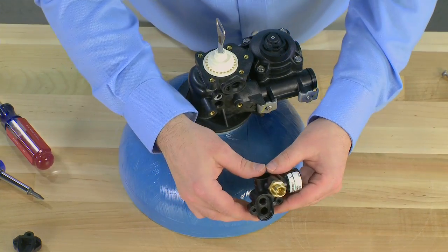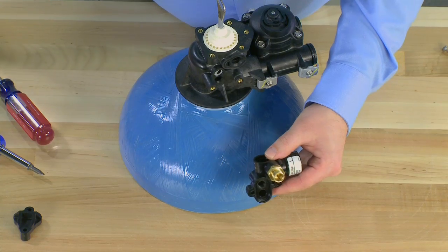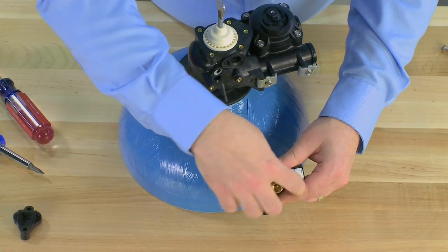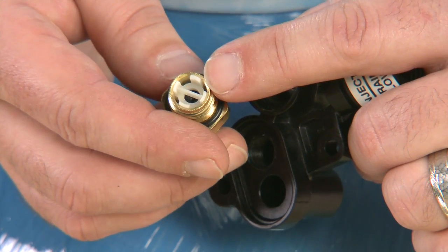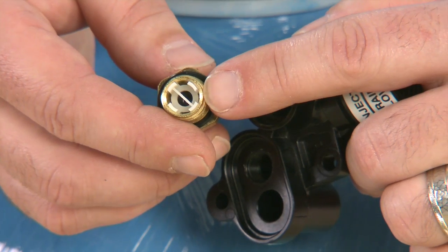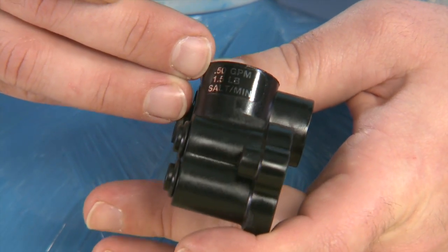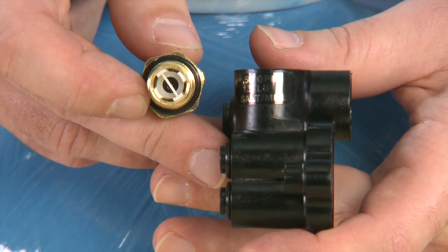As we move back to the brine assembly, we can go to the brass piece, which is our brine line flow control. This is removed by using a three-quarter inch wrench in order to unthread it. Once removed, we want to look into the orifice in the center of the unit to make sure it is free and clear. This controls how much water runs out to the brine tank for a softener. If necessary, when we replace this, we want to match the tag on the front — such as this one rated for half gallon per minute — with the brine line flow control to make sure the unit works properly.